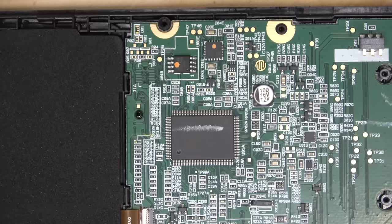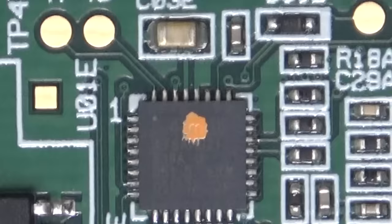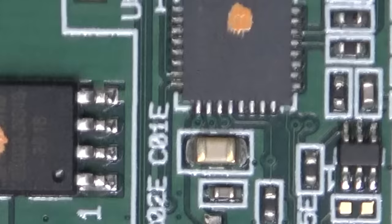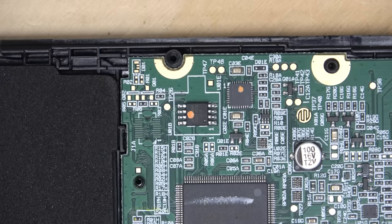Alright, so here you have your main CPU, which is still an 8-bit descendant of the Z80 running all that legacy software. And then this little guy right here, that is an ATSAMD21E18A-U. Oh my gosh. So that's actually something very similar to what we use in our pinball machines. So that's going to be an ARM Cortex M0, 32-bit, 48 megahertz.